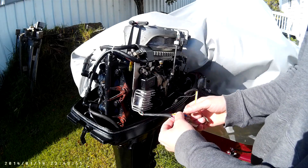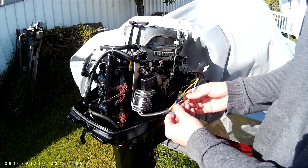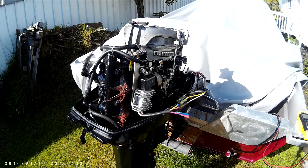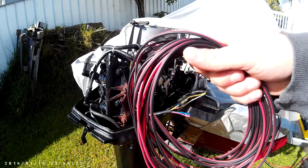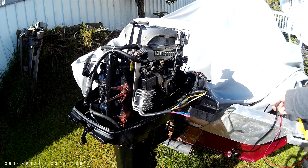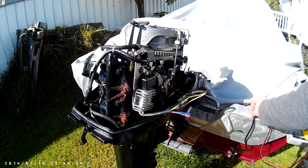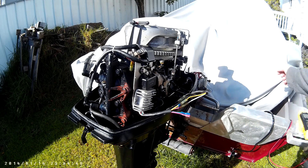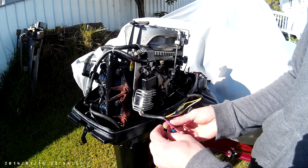That's all I wanted to show you guys. Now I can plug them back — yellow with yellow to make it a bit better. It should work! Black, red — great. I've got some fuse that I want to put close to the battery and the junction box, and some cable I'm going to put through the whole box. I'll just put a little plastic cover to protect my fish finder cable. That's what you do when you're lazy but want to protect yourself in the future — if I put a hook over it, it will just destroy the cover, not the cable.